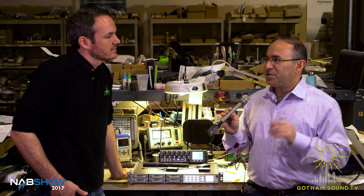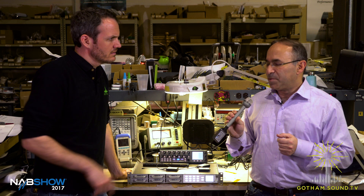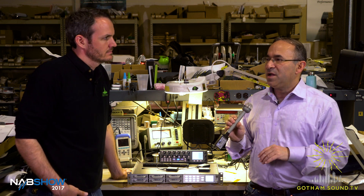And I noticed there's no antenna on this. Well, that's right. This is the first transmitter we have made that incorporates the antenna inside the pack. The range on that would be reduced a little bit from our typical whip antenna units, but certainly the people that do this kind of work only need very short range. With this, you would still expect to get 200 feet of range, so it is still decent. Definitely designed to go on a microphone and not so much on a boom pole, even though it could be used that way in a pinch. And does this do phantom as well? Absolutely — this also does 12-volt and 48-volt phantom power. Both this transmitter and the ZMT Phantom are balanced input, as opposed to a single-ended unit that's been adapted, so you don't have induced noises like lighting buzz. It's just a very super clean transmission and recording as we typically provide.